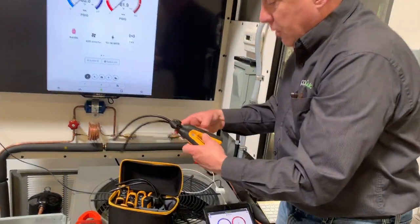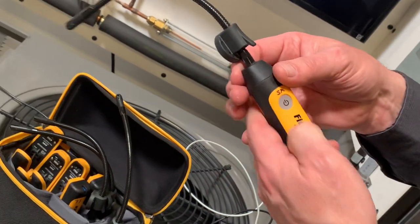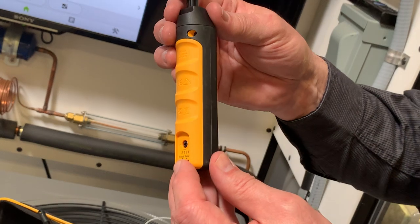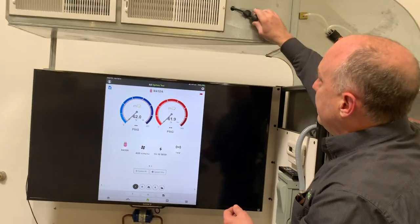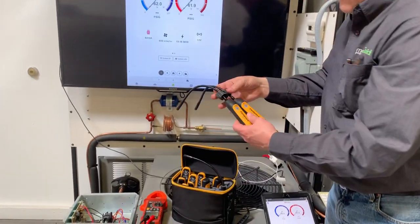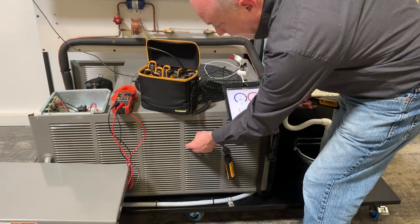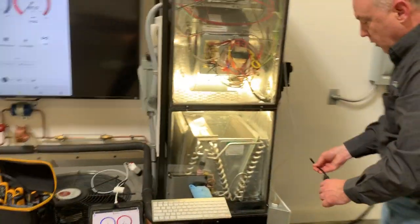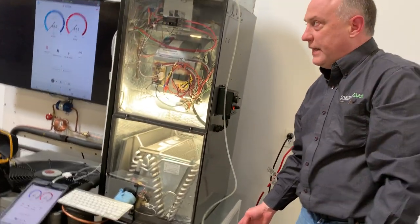On the probes, what I did is I took and marked every one of them. You can see this one is marked for supply air, and obviously these two have serial numbers on the bottom. I can just never remember which serial number is which, so I just marked my probes so I can identify them easily. We'll go ahead and put the supply air probe in the system. I've got one marked outdoor air and one marked return air. We'll set the outdoor air probe going into the condenser, out of line of sight of the sun, and then clamp the return air probe inside the unit.